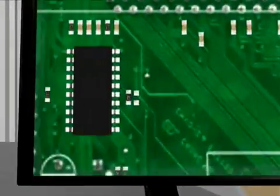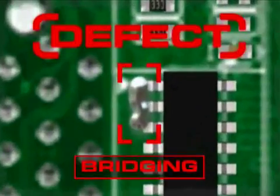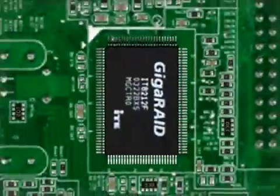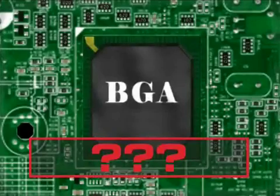With so many choices of inspection, what makes RPI special? As you can see in this animation, your PCB is being inspected with the ubiquitous AOI. AOI is great for picking up bridging, tombstoning, and other visual defects. But what happens when you get to the BGA? That's right — the defects are hidden from view.